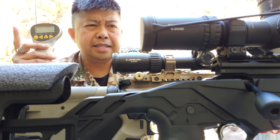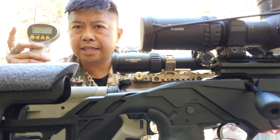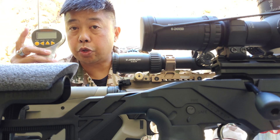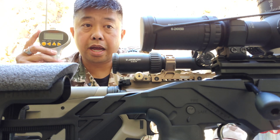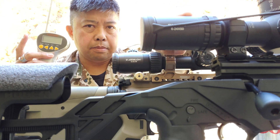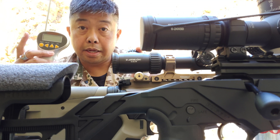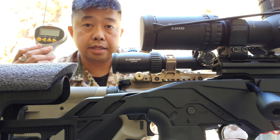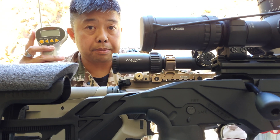It got me wondering: is that an inconsistency in the trigger of the Ruger, or is it an inconsistency potentially in what Lyman claims to be the most accurate trigger pull gauge on the market? I thought it's worth testing this out. I figured let's test that out on my Ruger and also test it on another trigger — a Timney four pound drop-in trigger on my AR — and see if it would also record consistent or inconsistent numbers on my Lyman. We'll see: is the Lyman lying?